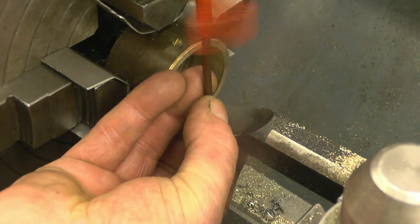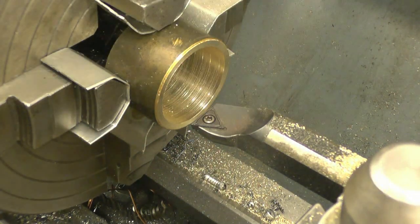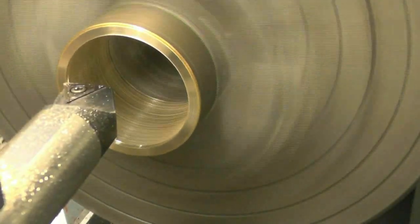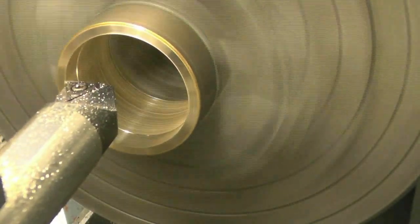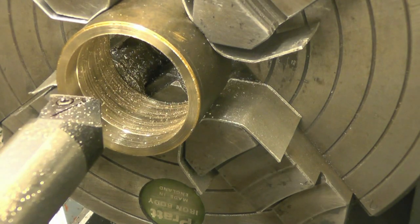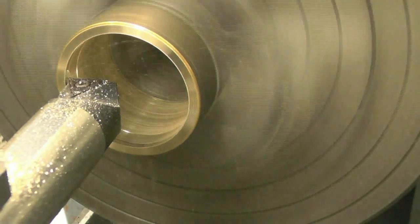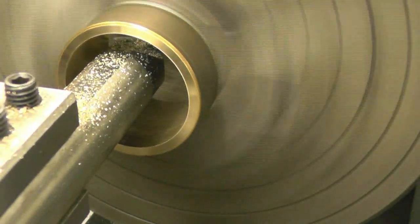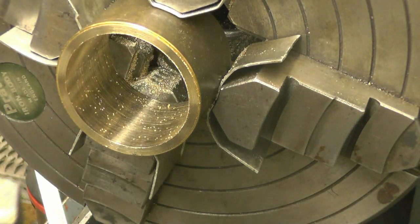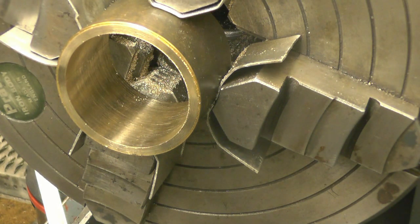As long as you've got a spare screw for these two rollers, you'll never drop the screw. Once you haven't got a spare screw, you'll drop it and you'll never find it again. Right, give that a try. Looks better. I'm going to screw the feed wheel down a little bit. That's decent. You don't actually want it too good a finish because it does need to hold some grease. I'm actually going to put a grease swirl into there once it's out of size.